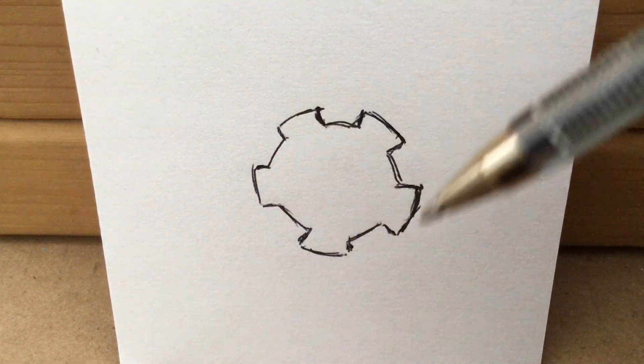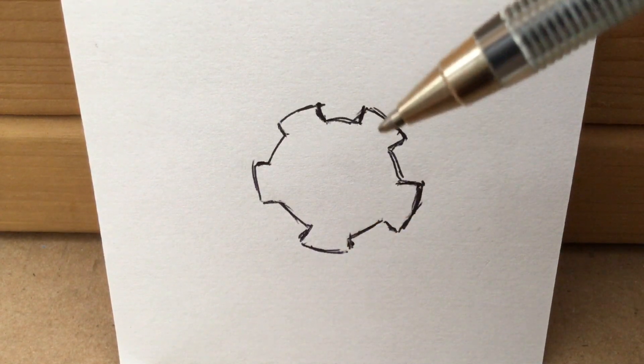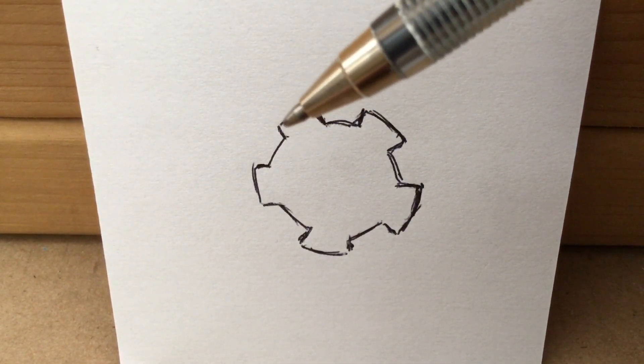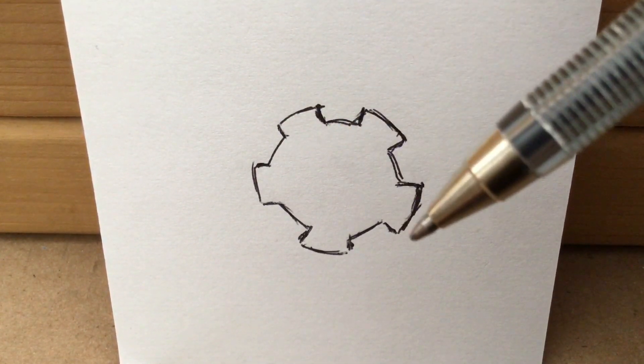You've got a five-groove barrel here. These are the grooves: one groove, two grooves, three, four, and five. If you measure directly, you will measure the biggest dimension and what you'll get is from one corner to the corner on the other side.